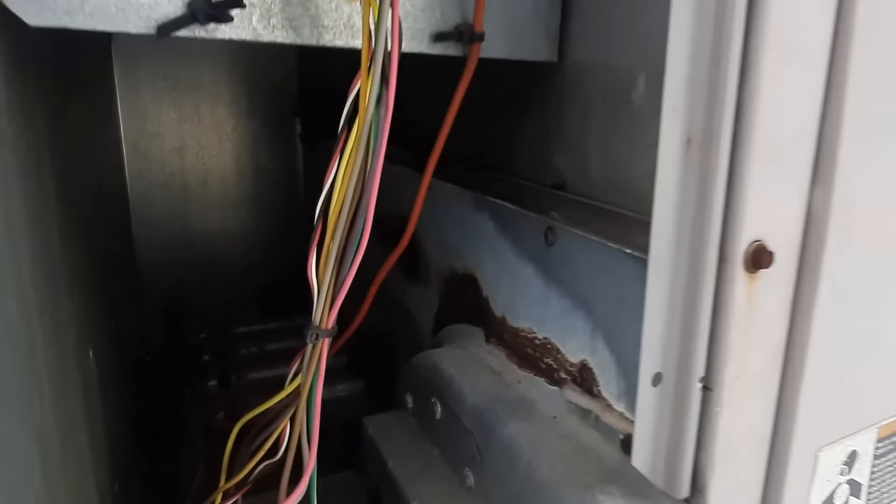I'll have to come back and do something with this insulation - I'm not sure what yet. This is an old unit. The insulation is everywhere - discolored, missing the foil backing, it's all gone. That was all in there clogging the coil. We got the coil clean. It looks good now - there's still a little bit of debris in the bottom. This is going to fix my temp rise problem. The question is - I don't know what kind of chemicals they're using down below in the lab and if that has something to do with the insulation breaking down.